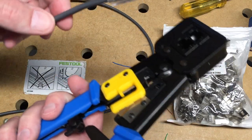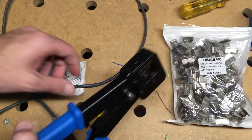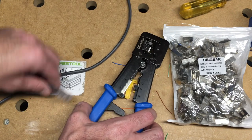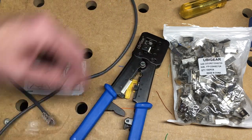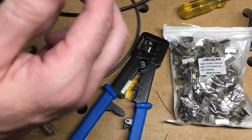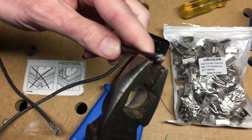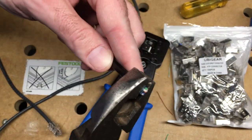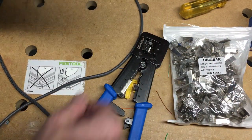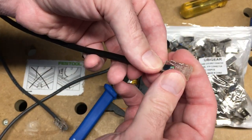This is relatively affordable — I don't remember the exact price but I usually look on Amazon. Especially if it's worth your time, if you're messing with these and having a lot of trouble, I found these to be a lot faster. A couple of things: if you're using a shielded cable, I found it helps to take a pair of pliers and kind of smash the end before you stick it into the connector, because it's a tight fit there.